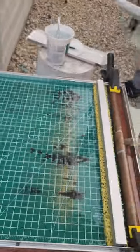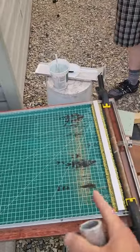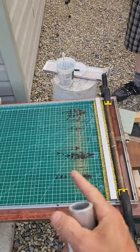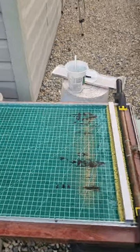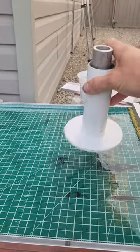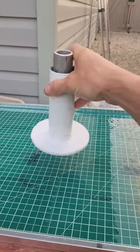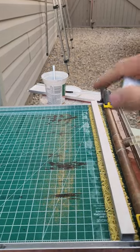Now if I stick this right down to the surface to suck the black sand to the end of this, it will actually pull some gold up with it — gold that gets mechanically captured between two pieces of black sand. So it's best at this point to just waft it over the surface, and then the magnetic portion will basically walk down the table just like that. What's remaining is black sand that is non-magnetic.